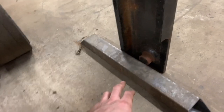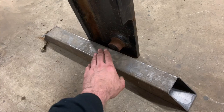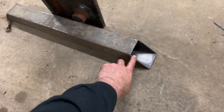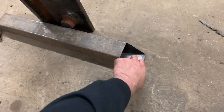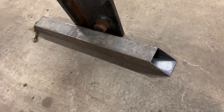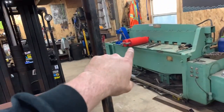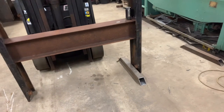This is what I have set up for my feet. I'm obviously going to put this here, reinforce this piece, probably cut out a quarter or three-eighths piece and weld all this solid as much as I can. To maximize my working area in the garage, I'm actually going to make these telescopic. I'll get another piece of HSS — this is three by three — I'll probably go with two and a half, since the inside ID is actually two and three quarters. So if I got something around two and a half, I'll be able to make something telescopic that I can put a pin in, pull the pin, and haul it out as needed. It doesn't really want to tip over because it's so heavy with a lot of straight-down pressure, and once those hydraulic cylinders are up there, that's another couple hundred pounds hung from the center. I'm going to tack all that in.